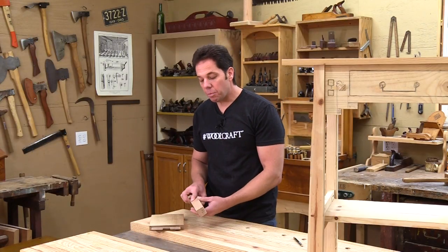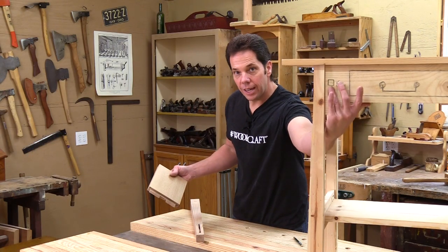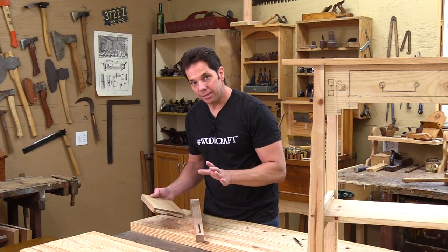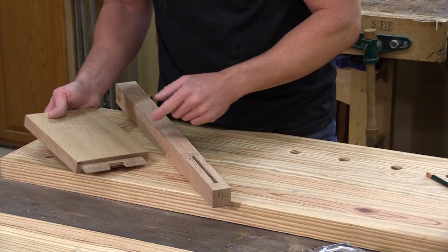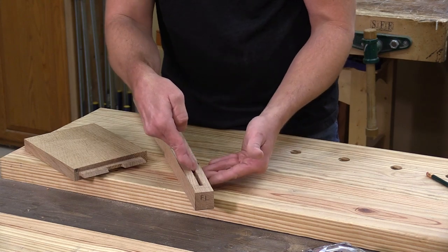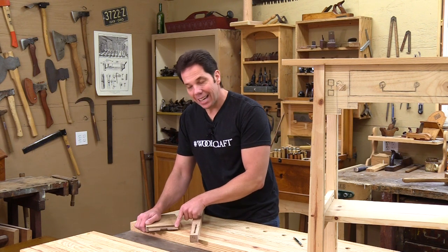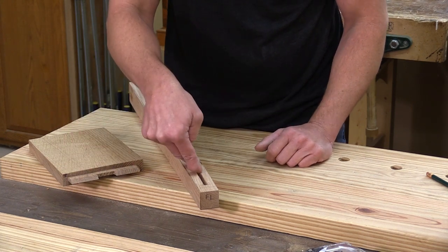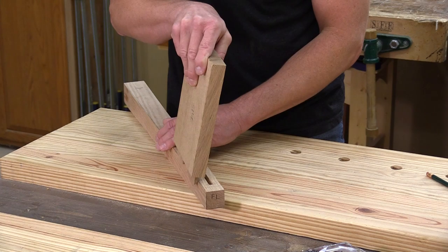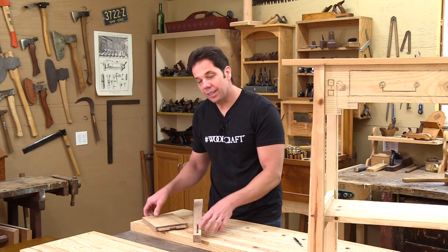I have here a practice piece of the leg and a sample of the size of what's going to be the apron. The method I'm using on this one is a double mitered tenon. The purpose of the mitered tenon is to give me maximum depth going into the mortise, because I'm going to have two aprons coming in and this allows me to get to the full depth. I also have a double tenon — if this were one big tenon it would create a very weak part of the leg under stress. By putting this notch in, it's like a little bridge, making this portion of the leg stronger.